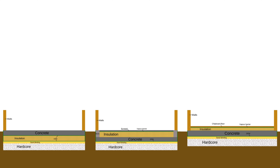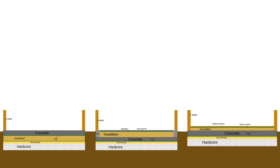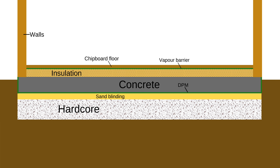So what else is different between these options? Linking back to the video about reducing the depth of a timber floor to maximise ceiling height, options 1 and 2 are clearly the best for this purpose, as you'll only use a few centimetres to get to your finished floor. Option 3 will end up being a bit higher, but that can be a good thing, as with some doors the sill and the threshold together mean you have to step over them. Mine came to about 10 centimetres above the ply, so with option 3 you can lay down 50mm insulation, 18mm chipboard, underlay and flooring, and come out almost level with the top of the door threshold — so that's a bonus.